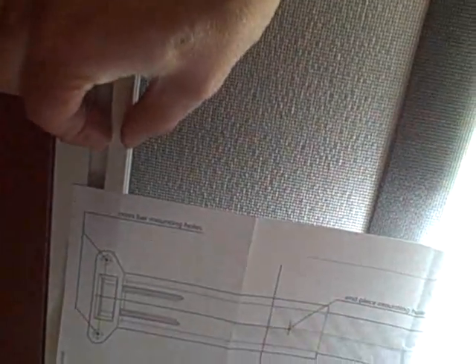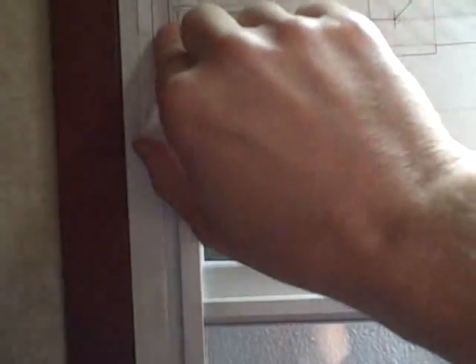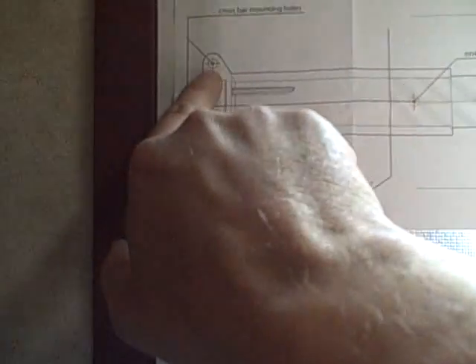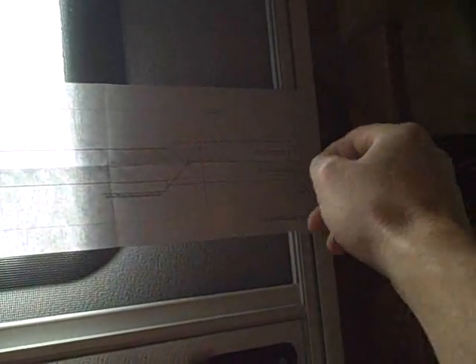The problem is I'm dealing with this narrow area I'm trying to hit the very center of, as opposed to this nice wide area where I wanted to mount it — but the bar is not wide enough for that, as we already discussed. So I'm tempted at this point to just use the end of this template to drill one hole, then screw the bar on with one screw, level it, and then use the actual plastic end mounts on the bar as a guide for the other screw holes, because this template is just not making me happy.